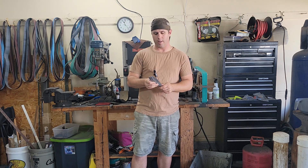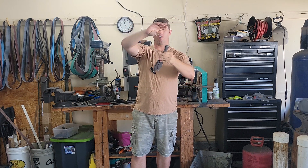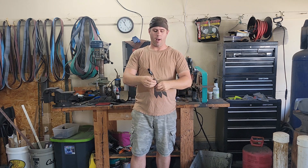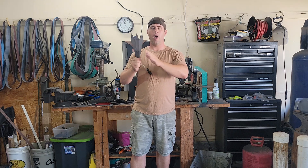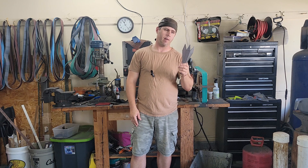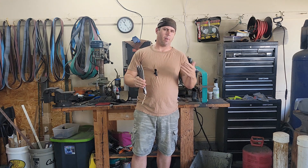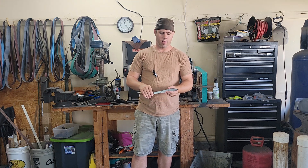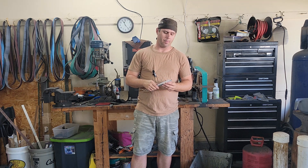So let me go ahead and fire up this forge. Let's get these up to temp and then we're going to quench them. In case you're wondering, I have them in sets so that they're made pretty much exactly like one another, and I don't want to get the knives mixed up. I'll do this set first to harden it, then put the wire back on and temper it. That way we don't get our knives mixed up. Alright, let me fire up this forge and let's get hardening.